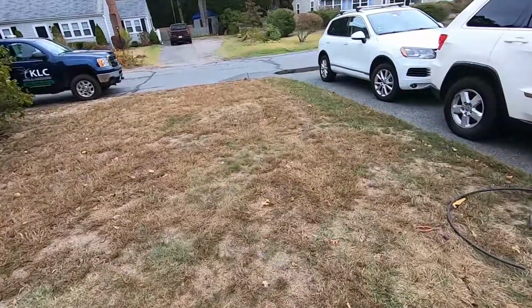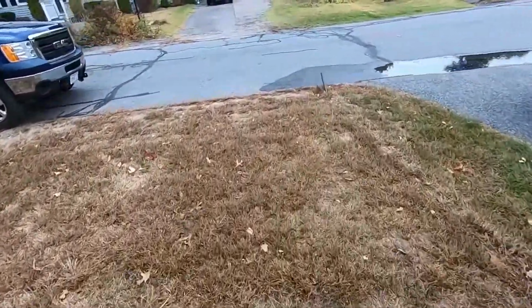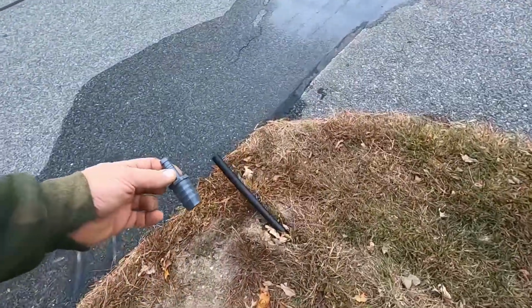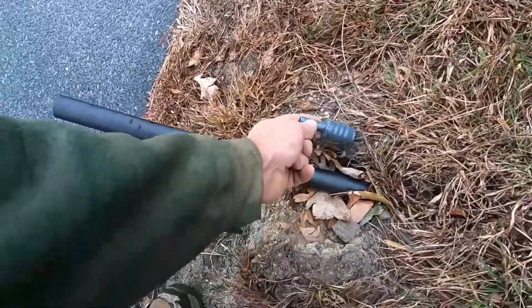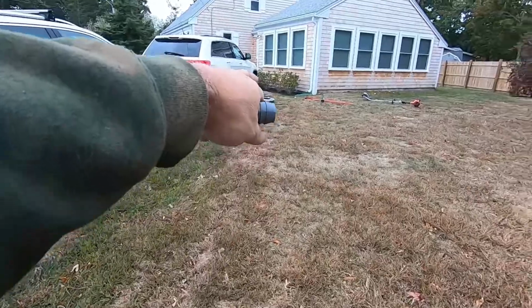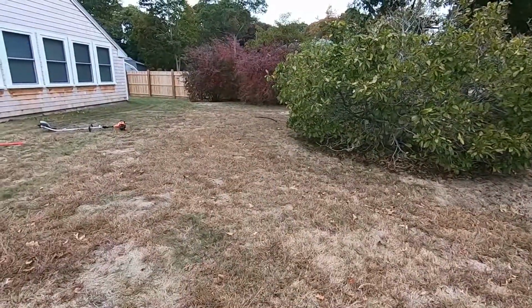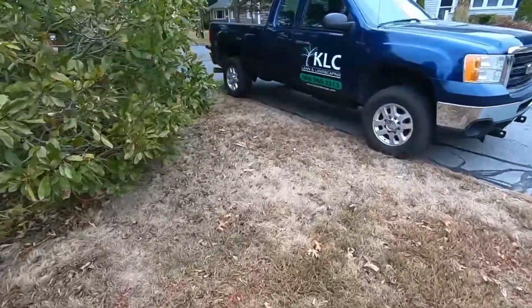I'm going to go ahead, there's no sense in showing you how to do this last one. Basically it's the same type of thing, only instead of the T, we're just going to have this here. I'm going to cut this pipe back, put a clamp on, and then run the funny pipe right off of this. And this will be the last head in the zone. So we'll have this head, that head on the zone, and then we've got the 1-inch pipe. We're going to do the same thing on that, cut it back, put one of these on, and put the head in right over there on the right hand side. So let me finish it up and then we'll run through some zones and take a look at the finished product.